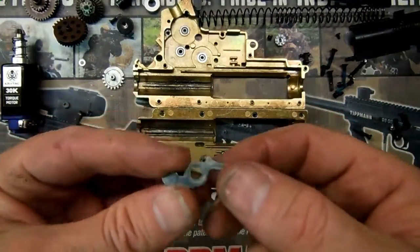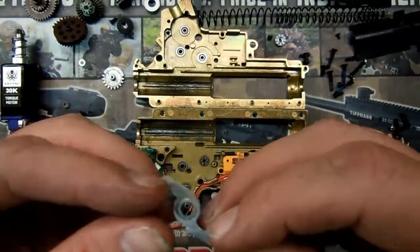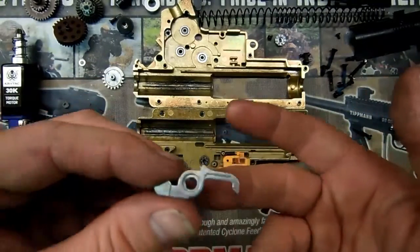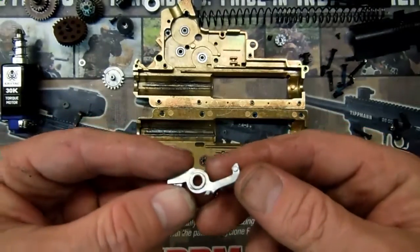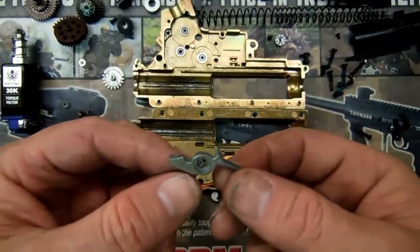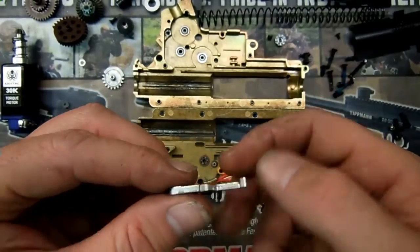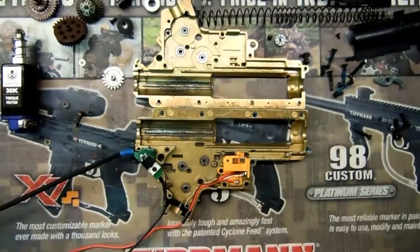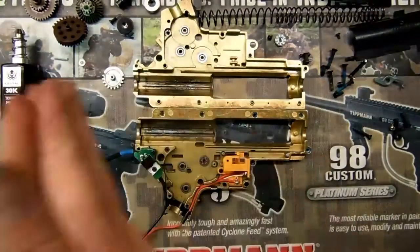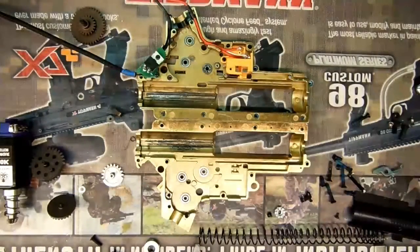Cutoff lever could have been a little better. It's a standard cast cutoff lever. But at the prices that you can make a steel cutoff lever, especially since everything's cast already anyways, it would have been better to go with the steel cutoff lever rather than the cast zinc alloy or aluminum stuff. It would give it a little better wear properties.